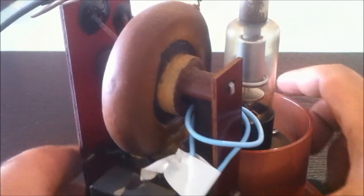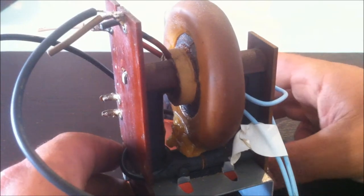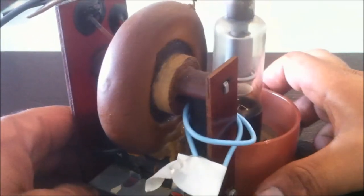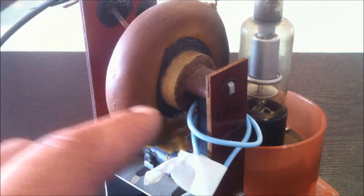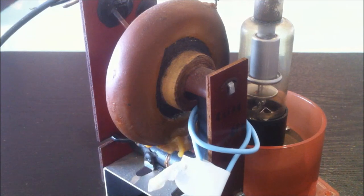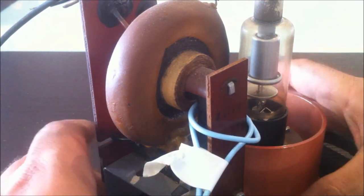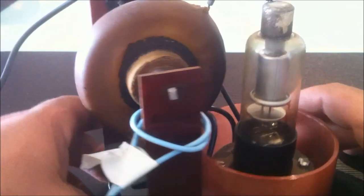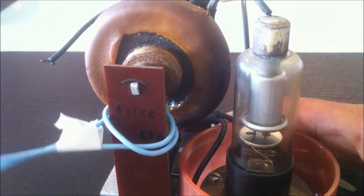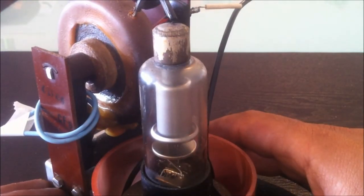The other thing you can find in the really old TVs are these flybacks here. This one here has got to be my oldest flyback that I own. You can see it's got the wax covered secondary. This section here is the primary coil. This blue wire is just my primary that I had connected to a 12 volt halogen light transformer, just to test it to make sure that the secondary coil was still working, which it was,